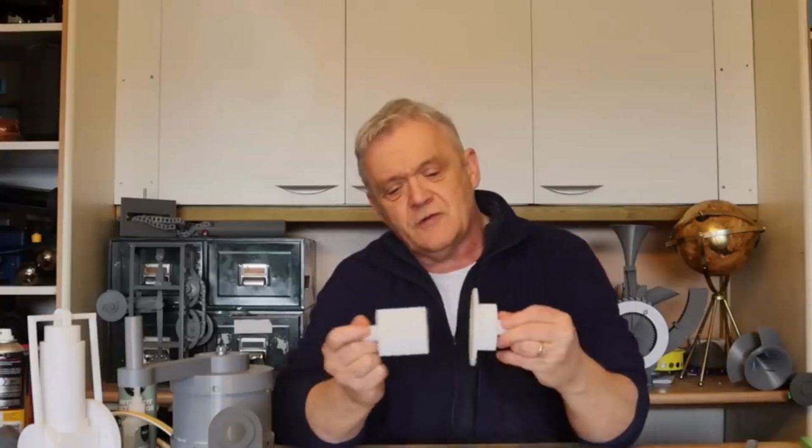And to put that together, what we need to do is put some bearings in there. They're skater bearings, so they're 22mm by 7mm by 8mm. And in the sun, we've got an 8mm hole. So we put a bar in there that juts out just big enough to go into there, so it makes one unit. And of course we want that to spin freely, because the spinning of this needs to be independent of that, and so we put a washer between them.